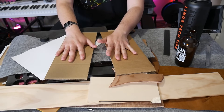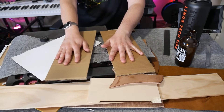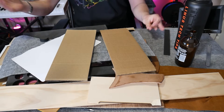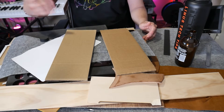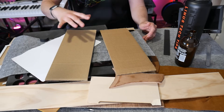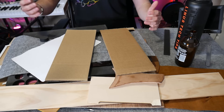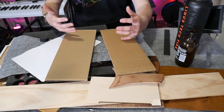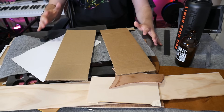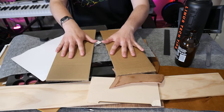We'll start with natural materials. The general rule of thumb is if it's a natural material that you can burn in a campfire or fireplace without worrying, then it's probably safe to laser cut. But keep in mind it'll still generate smoke, it'll still generate carbon monoxide, and it still needs adequate ventilation. This is just my opinion based on my experience — do your own research, and whatever you choose to cut is at your own risk.